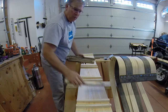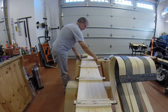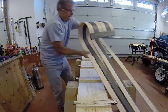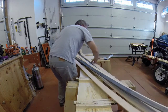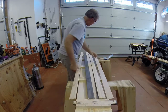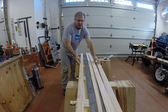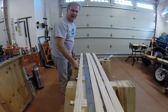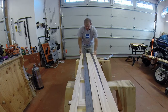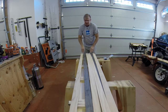We've got our form. We'll just go ahead and load it up with our crossmembers — upside down, of course. Then we'll take our toboggan and flip it over and get ready to start putting the crossmembers in. You're going to need a few clamps. What I like to do is make sure that when you start your first crossmember, it's exactly perpendicular to your headboard — the lead board — and they're fifteen and a half inches on center.